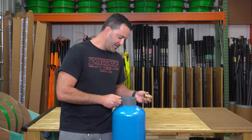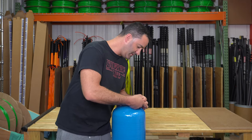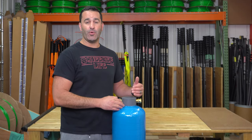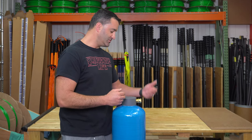Always make sure you use Teflon tape or Teflon paste when you go brass into PVC. Thread them in nice and tight. Right there you've just eliminated any leak points or weak points — no more plastic where you're putting a metal hose fitting onto.